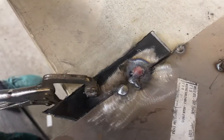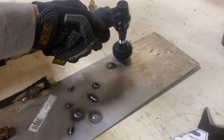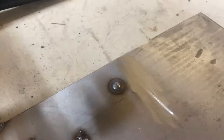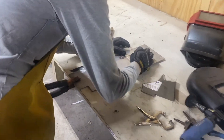Good weld. Good job. The butt weld is complete. Now we're just going to prep our surface for the next weld, which is going to be a lap weld. We're sanding it down and exposing the raw metal. That little triangle you see has already been prepped, and we're going to stick it on the new raw metal and weld them together.